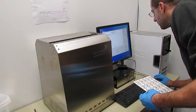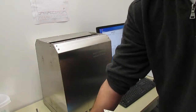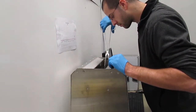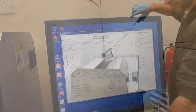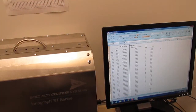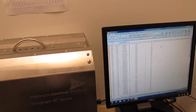For process control, we use an ionograph. After washing a board, we submerge it in an alcohol solution. As mentioned earlier, water-soluble flux residue contains ions, and these will dissolve into the solution and change its conductivity. Measuring this change shows us how much flux residue remained on the board after washing. Regular monitoring of the qualified cleaning process with computerized records of board cleanliness makes it easy for us to track our historical data and demonstrate process control.